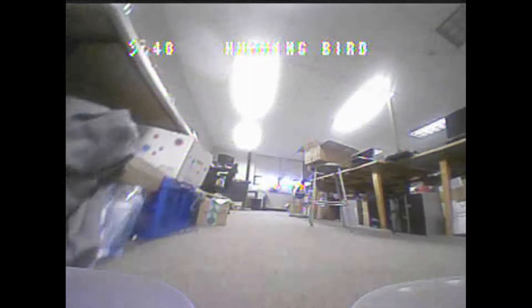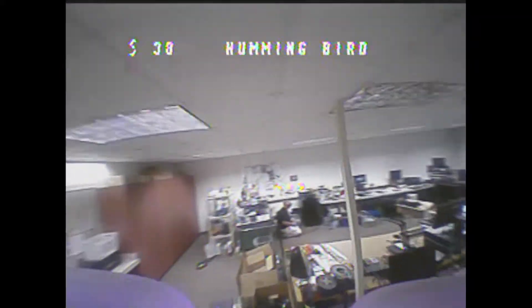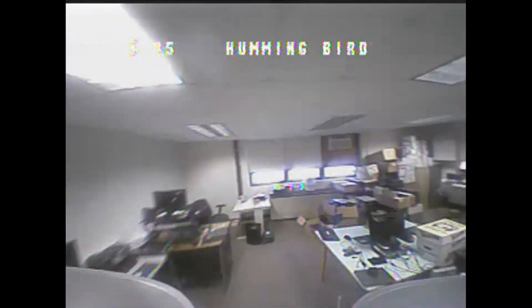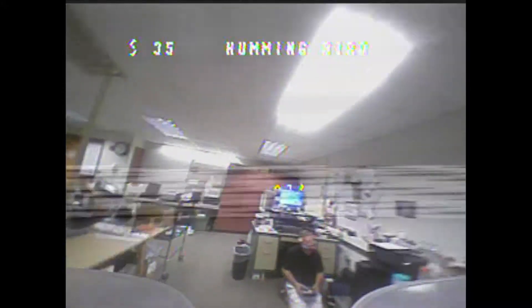This is after the wire mod — putting the wire on the flight controller and the camera. You can see the lines are still there, which kind of gives the reason for putting on the hex files that Newby Drone supplies. There's a no-OSD and an OSD version you can put on. This just shows that doing the wire mod without updating the hex file still really doesn't do much — the lines are still there.